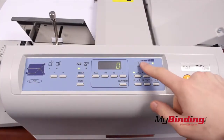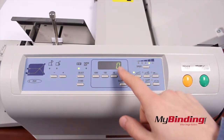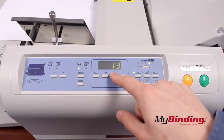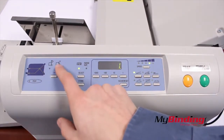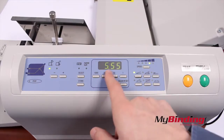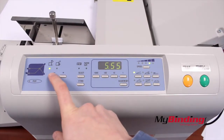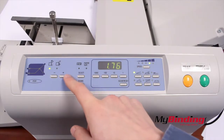Now for the control panel. First, you can change the speed. You can also set the number of folds you're going to make — in increments of ones, tens, hundreds, and thousands. To change the fold position for each tray, push select until the tray light is on. Choose the type of fold you would like to edit, then push the plus or minus buttons to change the position. You can see it changing on the tray. Now do the same for the bottom tray.